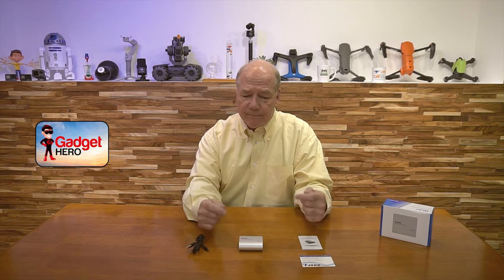The best part about it is the product will fully support 4K ultra high definition media through the device, and it also has adjustments on there for both ARC and EARC, so it's compatible with a wide range of products, as well as EDID settings that can follow output number one or output number two to adjust the resolution that's sent to the monitor. So stay tuned, and next what I'll do is take a closer look at the product and explain some of the features.